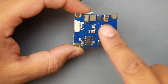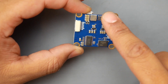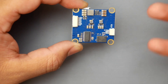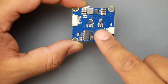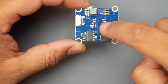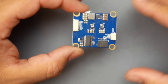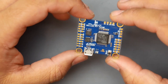I think one of these is a 3.3 volt regulator and one is a 5 volt regulator. This up here could be a switching 5 volt regulator — I'm not sure just yet. Also, if you take a look at this IC right there, instead of an SD card you're getting more onboard memory than the default chips. We also have the OSD here, which is really nice. The clean layout doesn't necessarily make it better, but it will be a lot easier to debug and fix if you ever need to — that's a huge plus.